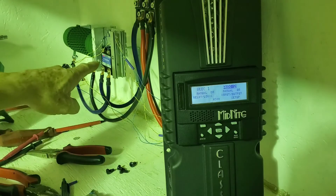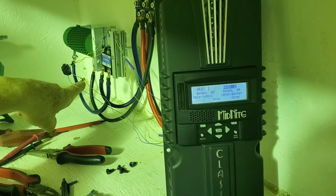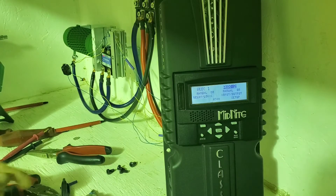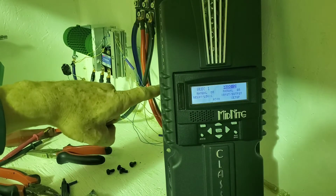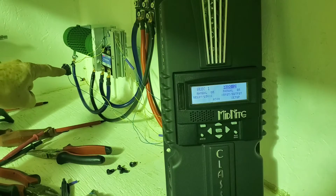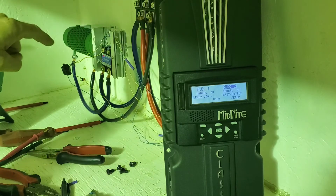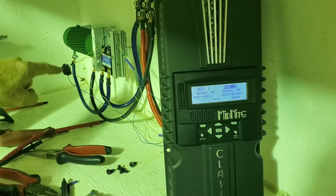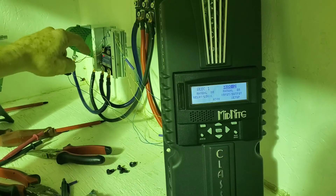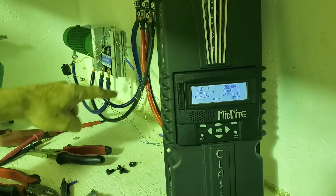So what's all here: there's an SSR, a normally open/normally closed relay, one variable resistor, two diodes — and that's it. You turn your Aux 1 on so it's continuously on with a 12-volt signal, and that opens this relay up all the time. And if the Classic ever shuts off for some reason, it turns this relay off, which connects these two wires together.